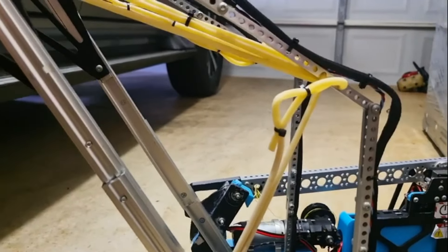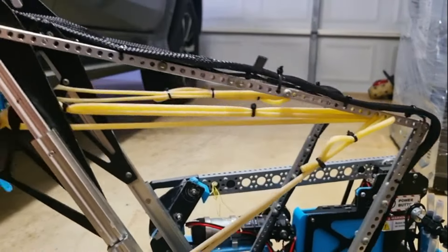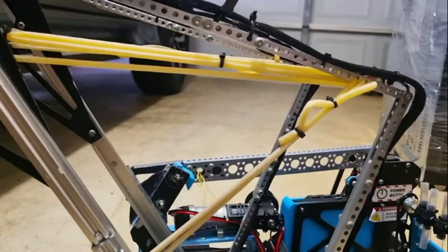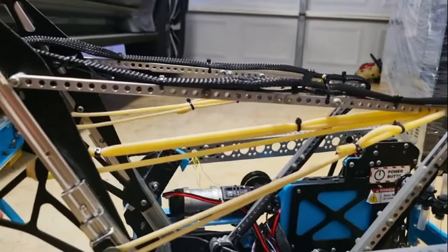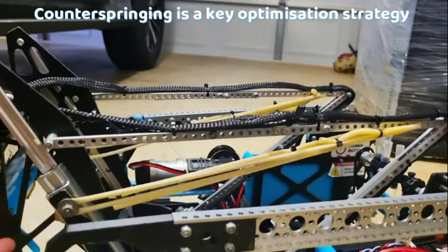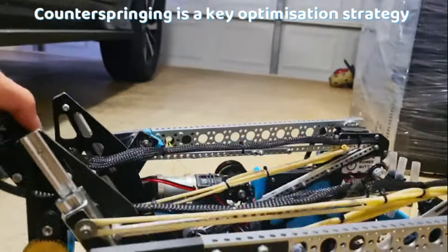The motor's mechanism is to rotate until the elbow of the linkage is more towards the slides. By adding a counter-sprung solution we're springing that elbow towards the slides, reducing the motor's load and overall increasing the performance of the robot. This also helps with speed, making the system a lot faster.